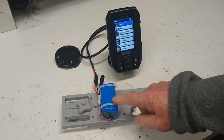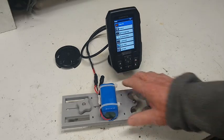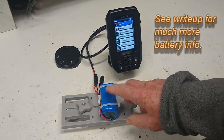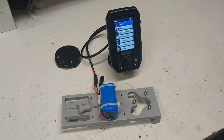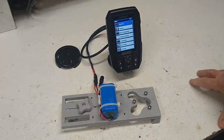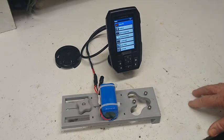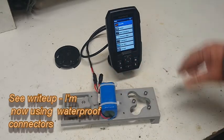I've mounted a battery on this one for the Striker. This battery is not included with the base. This is a four-cell 18650 battery — it's actually a replacement battery for a robot vacuum cleaner. It costs about 20 to 30 dollars and will power the Garmin Striker 4 for about 12 or 13 hours, so quite a long time. I changed the connectors out to something I wanted to use instead.